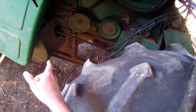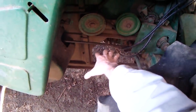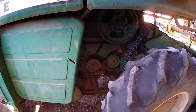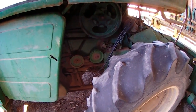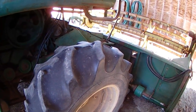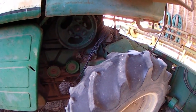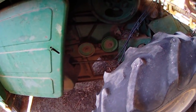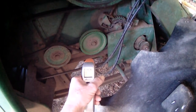Like the ones I was pointing out on the other side, there's a bearing right here and a bearing right there — you can't grease those. So what I've been doing with this tool, and I've done it enough times that I've got a pretty good idea what the bearing temperatures would be after this machine had been threshing soybeans for about 15 minutes. That's long enough to get them up to what would be considered normal temperature. I'm going to shoot that bearing right there — I don't know whether you'll be able to see the red dot; it's infrared.